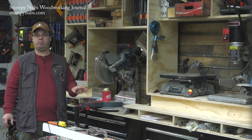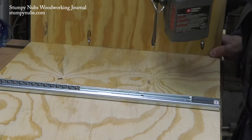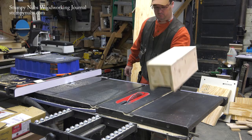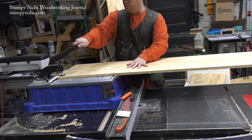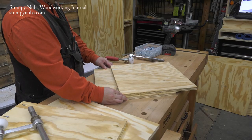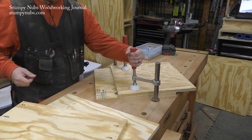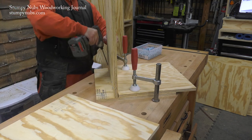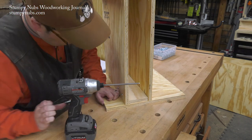In part four, I told you how my hole problems are ruining my life — how this cheap five-layer plywood crumbles if the pocket holes are too close to the edge. But I'm in too deep to turn back now, so I'm working that lever like grandma at a slot machine, and the payoff will hopefully be quick assembly without glue or clamps. Another problem with pocket hole construction is the workpieces tend to move a bit when you drive in the screws, and you look like a crap woodworker when everything comes out misaligned. So whenever possible, I clamp something down as a fence right on my line to counteract the force from the screw heads as I drive them in.